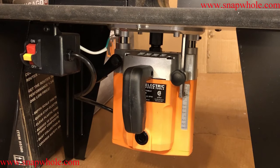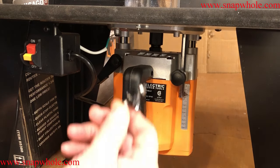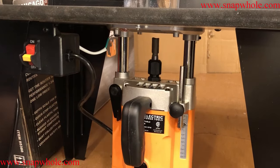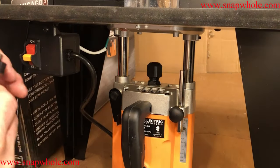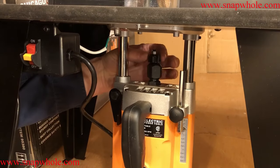You always want to keep this safety cover on when you're cutting. Three-eighths might be as long as half — I don't know — but quarter inch seems to be a lot more popular. I'm going to take the half-inch bit out because I want to try the round-over. Just for fun, let's use a rabbiting bit. I'm going to put that in — I know I need to raise that, but let's get the collet bit tight first.